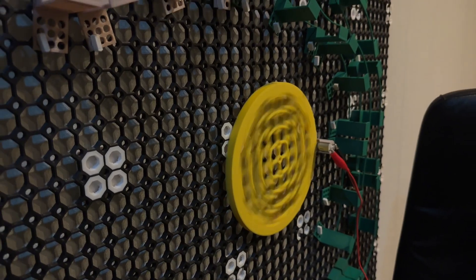But the motor still spins too fast — I need a gearbox to slow it down. Sounds simple, right? I've been stuck on this for hours. The problem was I couldn't figure out how to stack gears; every gear in my design was a different thickness, nothing lined up. Then it clicked: what if they are all the same? I picked one thickness, same as the multiboard, and spaced them evenly. The motor happens to be exactly five layers deep. Now I can put gears on any layer and step down smoothly from motor speed to something usable. I also cranked up the angle on those locking gears — hopefully they actually hold this time. Let's check it out! The gearbox worked.